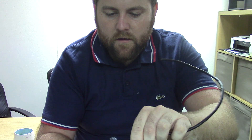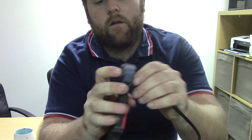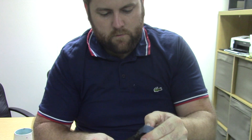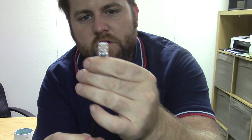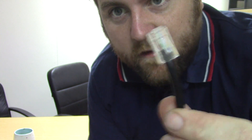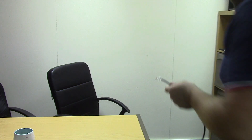So we're going to get our crimping tool, get it right around the RJ45, and give it a nice crimp, then pull it back out. When that's done, we're going to do a quick visual inspection — make sure all the pins have gone down and none of them have snapped or bent. And that all looks okay. That's it: one RJ45 connector, which can go straight to your router or into an RJ45 socket.